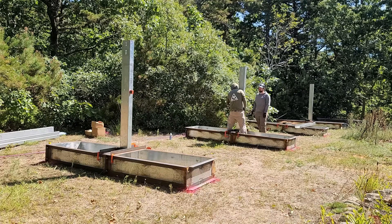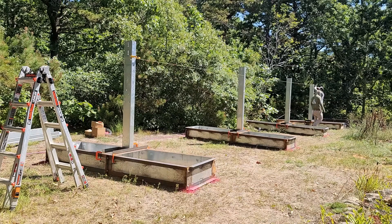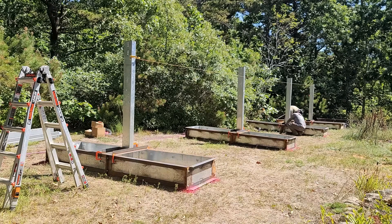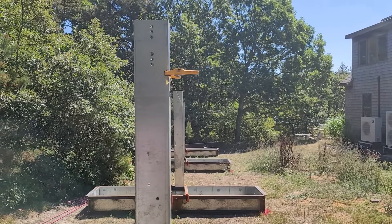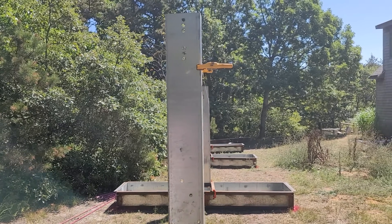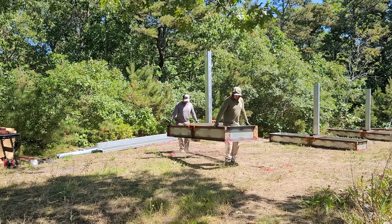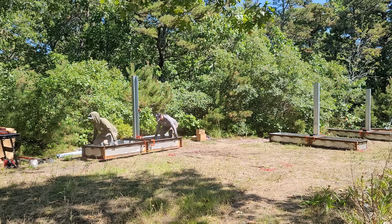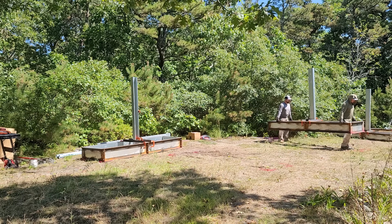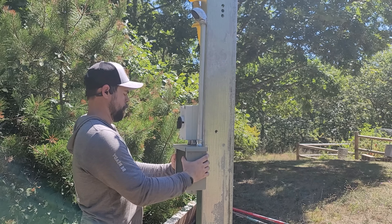We're facing a tricky situation — we have a small backyard and we're putting in 24 solar panels. We get all the posts and boxes completely preset and exactly where we need them so that once the concrete arrives everything goes smoothly. You can see everything is perfectly lined up and touching just how we need, but in order for the concrete truck to reach the far boxes we have to move the first two boxes out of the way. These things are tough to move around but they make the job a lot easier.